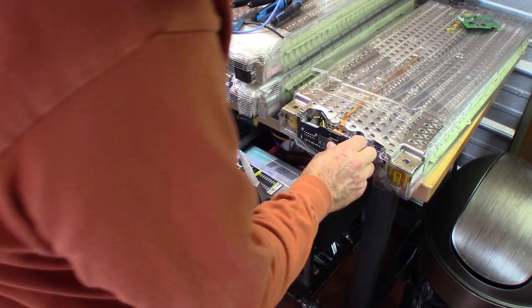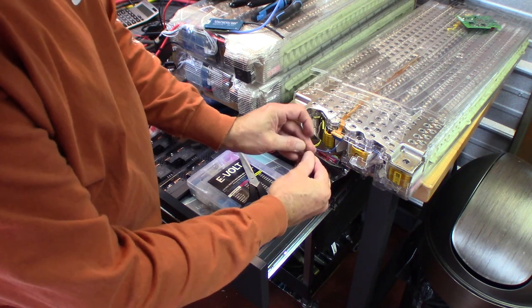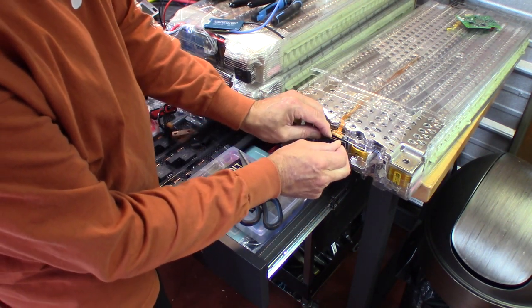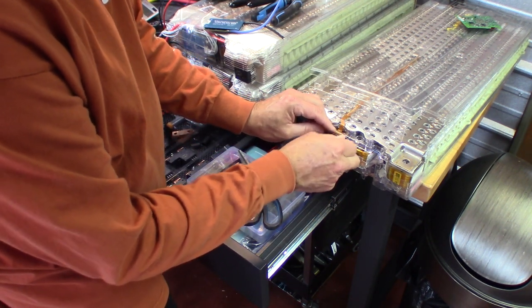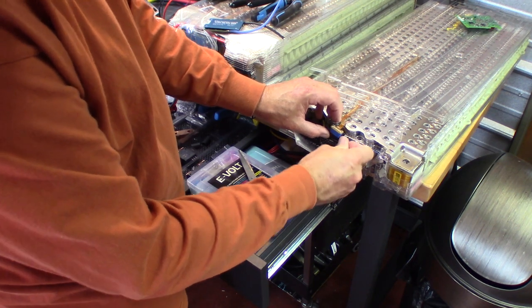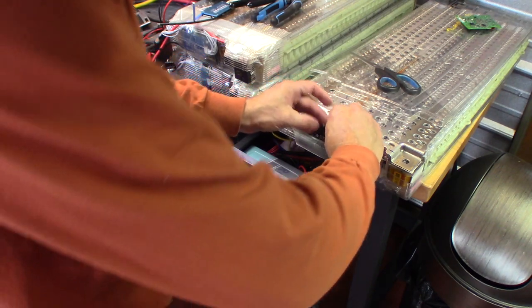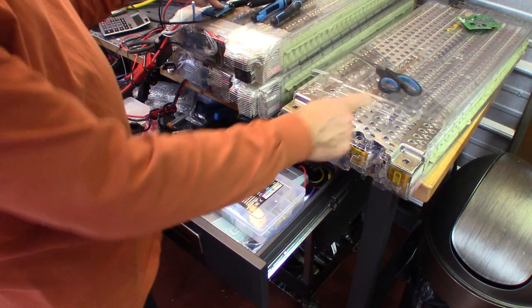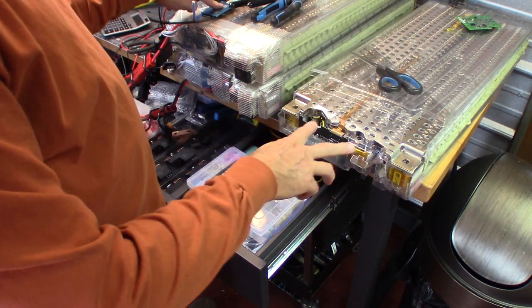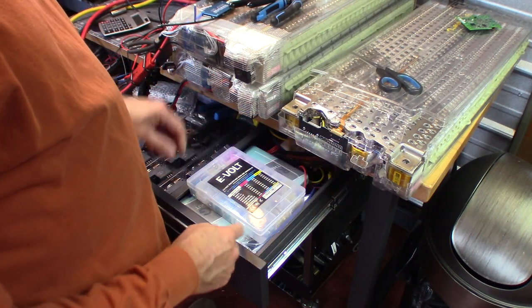Now we'll push the BMS into place, grab a couple of those pop pins that we were talking about, and reverse the process by putting the four pins. They fit in the exact same spot on the Stealth board as they did on the factory Tesla BMS. And then last but not least, go ahead and plug in our top edge connector, which these are all our battery sensing lines that bring all our voltages in from our six different cells.